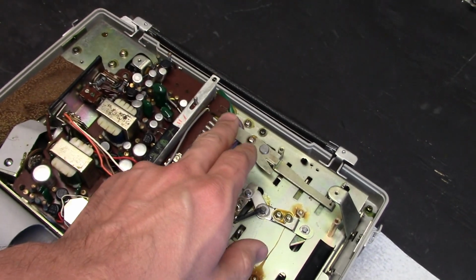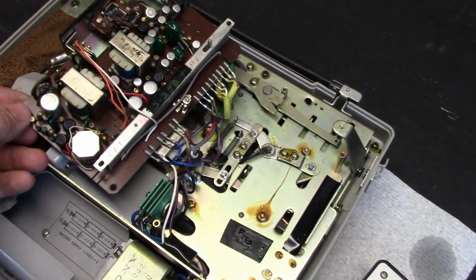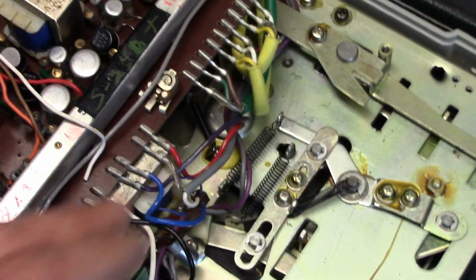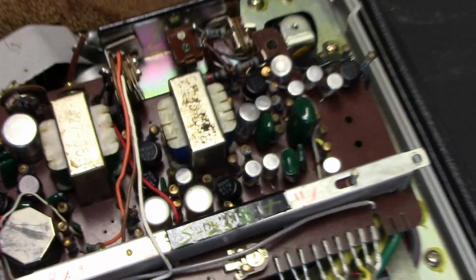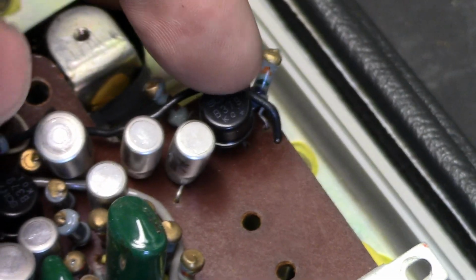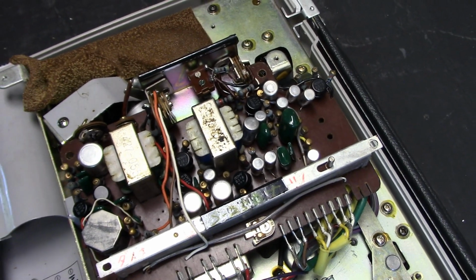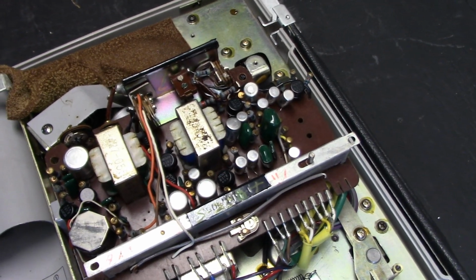That is, all the wires are on one side of the board and it's easy to get to the other side of the board. And all the wires are actually plugged in to the side, so you could easily disconnect it to service it. And I'm also very pleased with the transistors, they're all this case style, painted black too. They look really nice. I really like the look of the transistors in this unit. Also notice none of the transistors are heat sinked, but I'm guessing because of their larger metal cans there was less of a need to heat sink them.